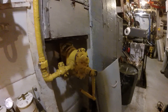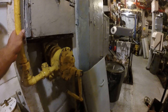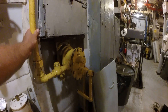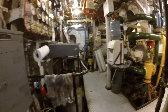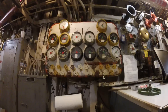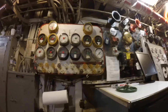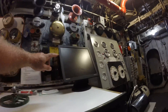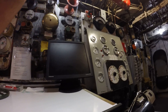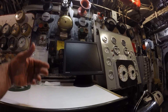This is an oil pump we prime the engine with before we start it. We hand pump engine lube into it and make sure it's coming out at the races on the camshaft. Over here is the control area with a lot of the gauges we monitor — pressures, temperatures. We have a modern day monitor here where we can see where we're going. We have a webcam up on the con so we can see whether we're entering a lock or whatnot.